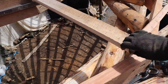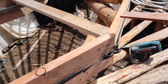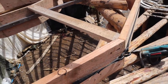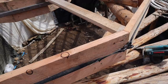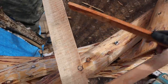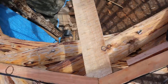Right then, it's the plan. Just rough cutting these joins. There's funny angles on them, if you know what I mean, because it's angled that way. We've got the two cuts, and they're not all exactly the same, because obviously it's not perfectly circular. So I don't want to spend ages getting all these perfect. I don't want these to not be resting on anything anyway, so I'm going to end up trimming out underneath these, so any gaps are going to be hidden by some nice trim, so that these have got something to sit on.